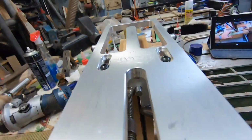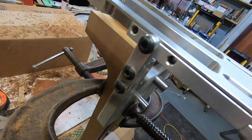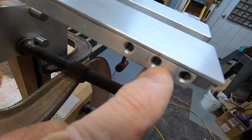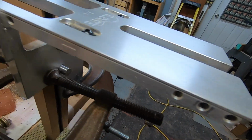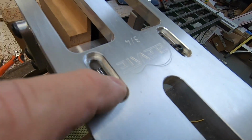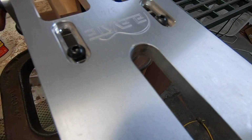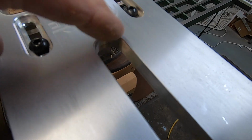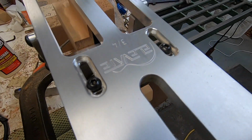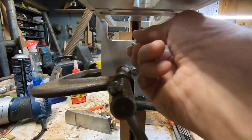this just sits on top after you've set your bevel. This bracket right here went from being down here in this center hole for the mortise to being up here in this center hole. Once you've set your slide here, that sets the depth of your mortise, or your tenon. It also counteracts, or by setting that, it makes both of these things end up in the same place when you're mounted. These have one centering hole right here when you buy them.